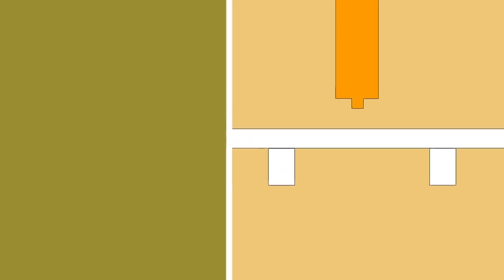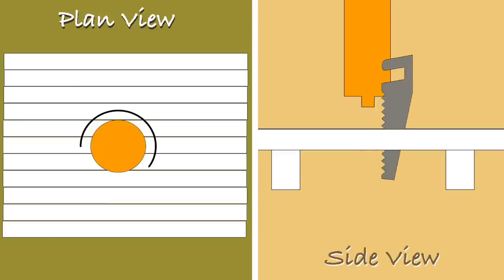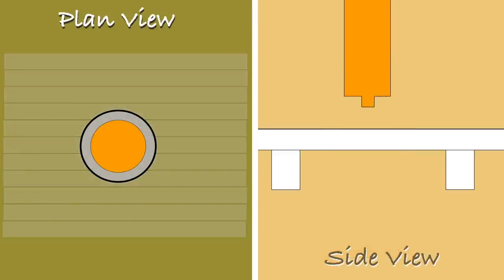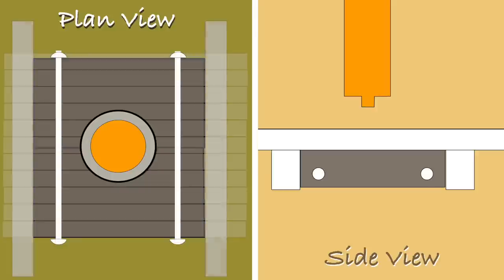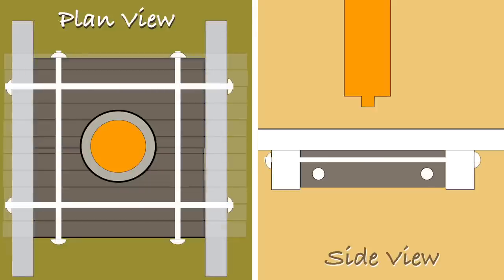Let's suppose we want to place the mast here. Obviously, first we have to cut the hole. Next, the hole is strengthened by fitting mast partners below deck, large oak slabs of wood that hug the hole. The two halves of the partners are riveted together with dumps, and then the partners themselves are riveted to the deck beams either side of the hole.